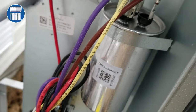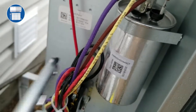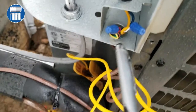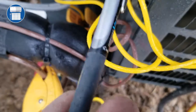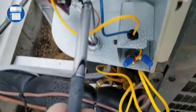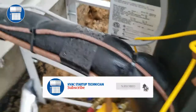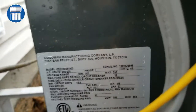I'll be taking the voltage of the different lines as I go forward. This here is where I make my connections — this is my thermostat wire coming in. I'm in Delaware so here they use white and red — you connect that. This is my contactor and the disconnect. And one more thing — we're looking at a three-ton unit, and you can tell it's a three-ton by that 36 right here.